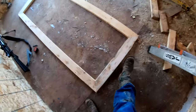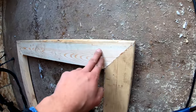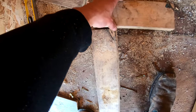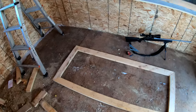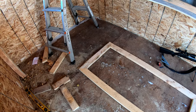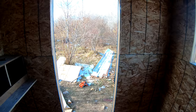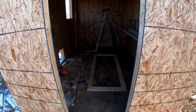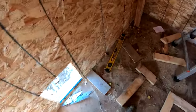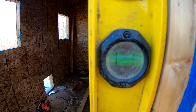Here's my door frame — I've got my 45-degree cuts in each side. You nail straight through as opposed to trying to nail a flat butt joint, which would just be a pain. I checked fitment — giving an eighth of an inch is pretty tight. I would almost consider going to a quarter of an inch in terms of width. But if I have to push on this door a little bit to get it closed, that's fine — I don't want to have drafts in the coop. I'm not putting a jam on this door because it's a chicken coop and it's perfectly level.